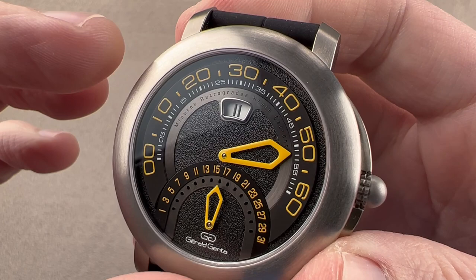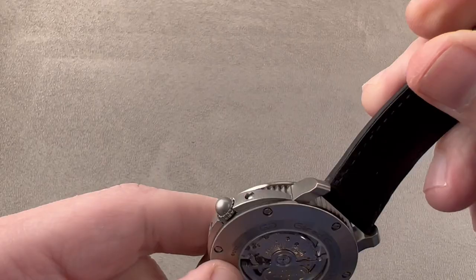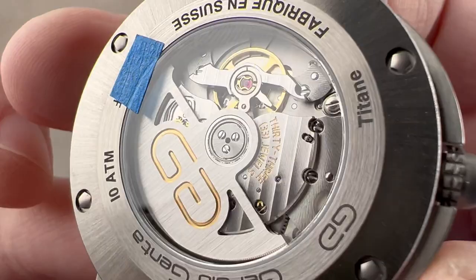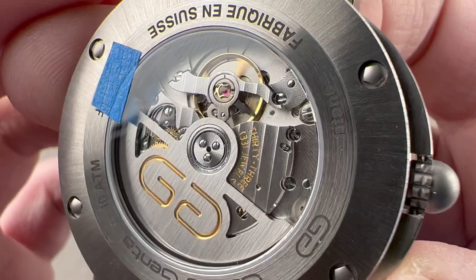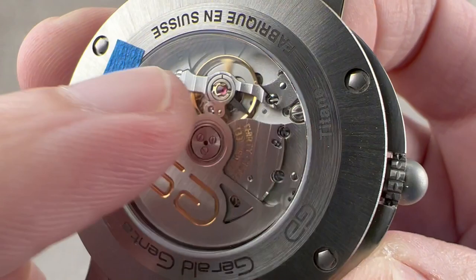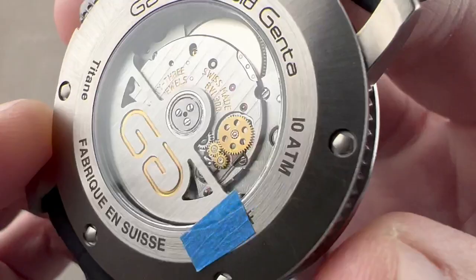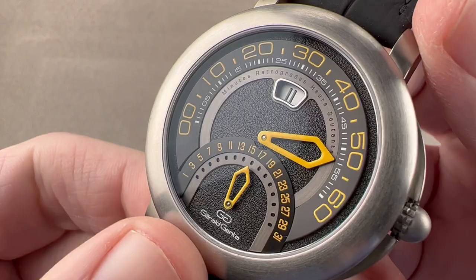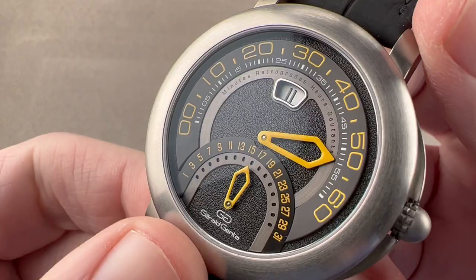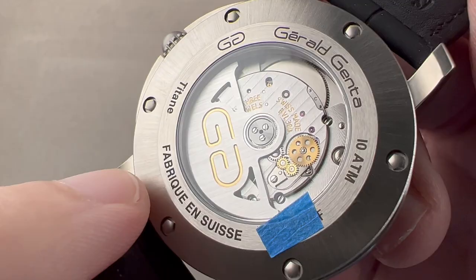Screwing the crown back in, let's take a look at the reverse side. The movement module is Gerald Genta's own, dating back quite a few decades. But unlike the originals, which would have been Gerald Genta branded and powered by either Girard-Perregaux or ETA, here we now have a Bulgari in-house movement — the BVL 300. The parent of Gerald Genta is Bulgari, but Bulgari's movement manufacturer is the old Gerald Genta works, so this really becomes something like an in-house caliber. It's an automatic winder with a 42-hour power reserve, a dual-anchored balance bridge for better shock tolerance, beating at 4 hertz — 8 beats per second, 28,800 vibrations per hour — and pivoting on 33 jewels. Water-resistant to 100 meters. It's BVL branded on the barrel bridge but Gerald Genta branded on the rotor, and of course it is Swiss-made.